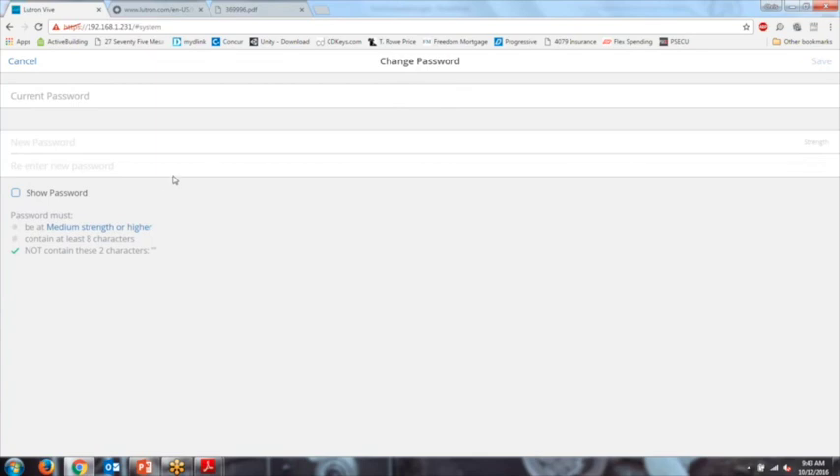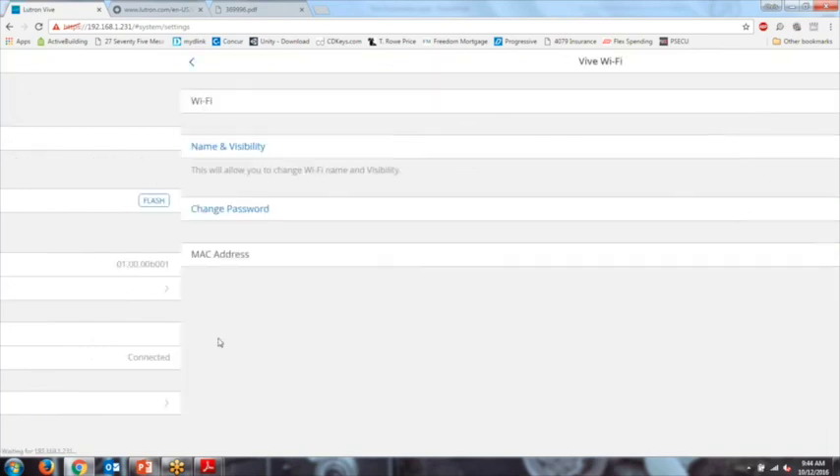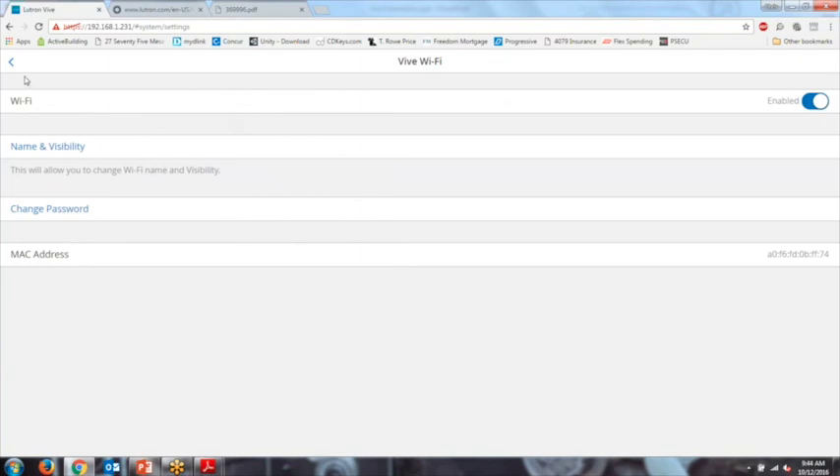For more advanced features: the system supports both a wired Ethernet connection and Wi-Fi. Out of the box the hub's Wi-Fi is not password protected or encrypted, but the very first action required upon connecting is to encrypt the Wi-Fi—you cannot do anything else until it's encrypted. Once encrypted you can change the password, and you can also disable the Wi-Fi entirely if the IT department prefers to use only the building network.